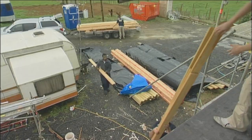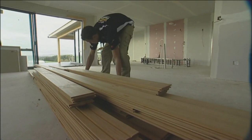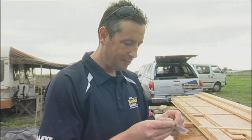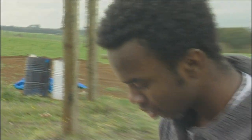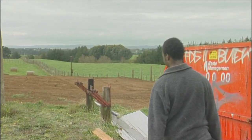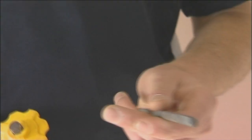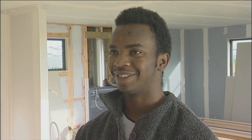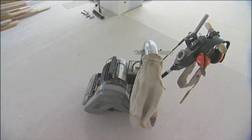Get this timber upstairs. One of the hazards of timber flooring definitely is splinters and slices from the timber, because the edges are quite sharp. Because we're using a floor sander, we need to make sure all the nails are punched down below the surface, so we don't hit them with a floor sander. So normally you need to use a nail punch, but I'm going to give you the PlaySchool version so you can't hurt yourself. It's got a nice soft rubber here. Timber flooring covers everything from possibly lifting up existing floor coverings, prepping the subfloor, laying the boards of course, and then sanding and coating.